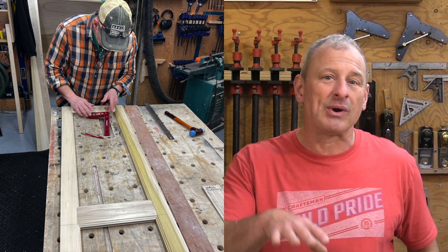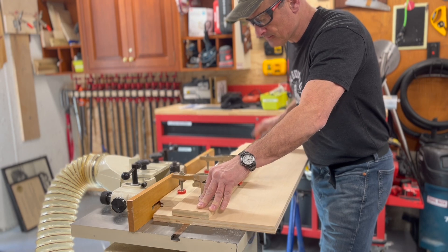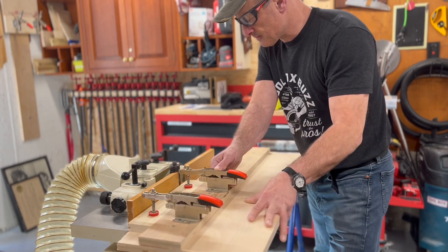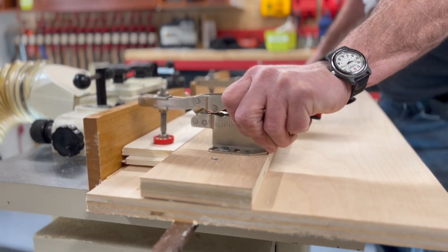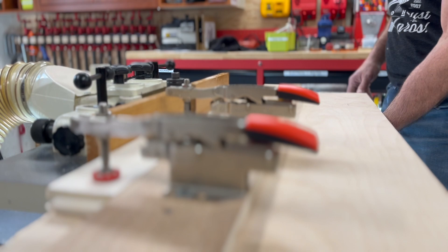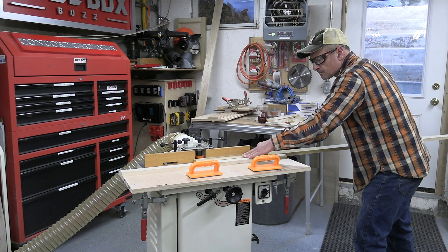When I do this I want to be precise and I use sliding sleds that index into the miter slot. Recently I've encountered some quality issues when milling long stock — for example, an end panel of a tall bookcase or a long horizontal wainscoting panel on a bench seat. The first problem was my 36-inch sliding sled was too long for my short 16-to-18-inch table, and when you slide it back to start, the weight can tilt it and lift up the front end.